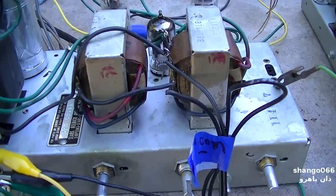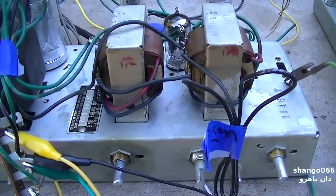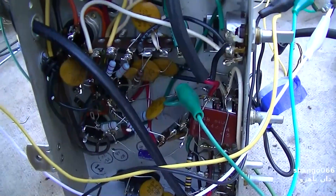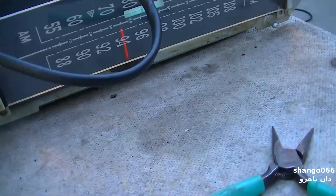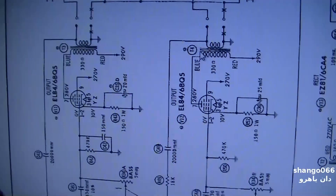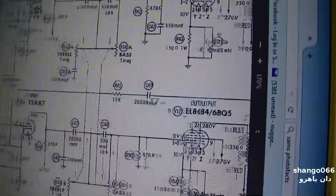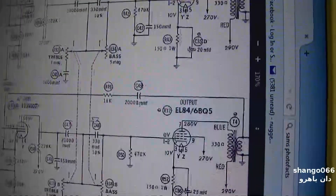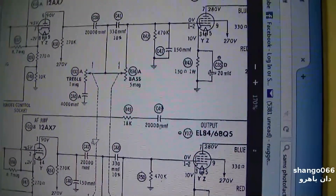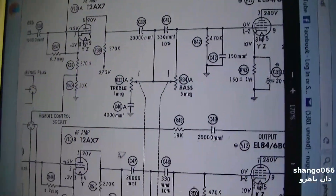I don't understand why it wouldn't be louder. I could try and drive that straight into the tube and see if something in the networking is the issue. It's the same if I drive it right into the tube. Taking a look at the amp — it does have feedback, and you can see it here. This line from the output comes back through this 20k/18k and then back to the cathode. That acts like a limiter — that's why it's like it's got compression. So I'm going to call it good. Sounds great. We'll see you soon, thank you.